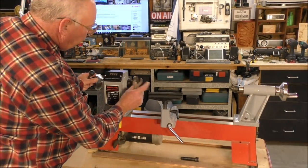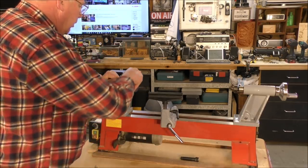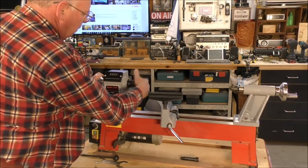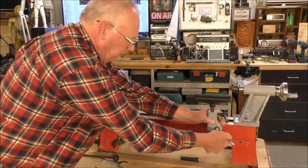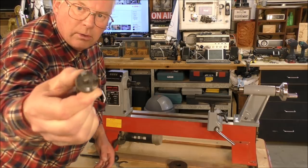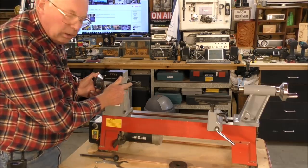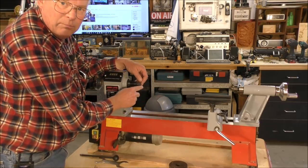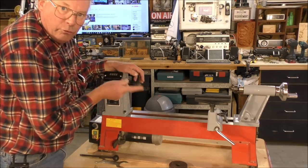Okay, so this is the basic machine. To remove the flange off here, you're normally given a lever that fits in, and that simply undoes. That unscrews. And you can also fit a spur drive, which fits into a taper in there, which is called a Morse taper. Then you can use your tailstock to squeeze a piece of material and trap it between these points, and this spur drive will drive the wood.